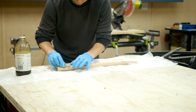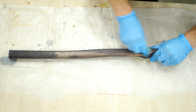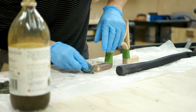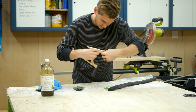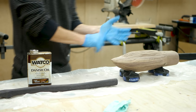Since I wasn't using ebony wood, to make the handle black I experimented with ebonizing oak. I mixed up a solution of steel wool and vinegar and let it sit for a few days, then came back and rubbed that solution onto the oak, and within seconds the oak blackened — and it was freaking cool, and it works really well. I also added a bit to the foot stirrups by taping off the edges, rubbing the solution onto the piece, and then pulling off the painter's tape, leaving a really cool distinguished color pattern between the regular white oak and the ebonized oak.